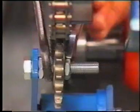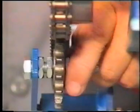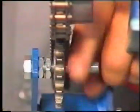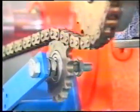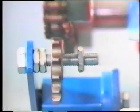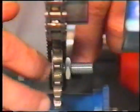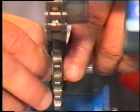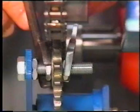On the drive assembly, the recommended procedure is to begin by loosening off both lock units. Next, start the unit and allow it to run, whereby the jockey wheel will automatically find its own centralized position, owing to the action of the chain. Stop the unit. When completely at rest, carefully turn the lock nuts up to the sprocket, then secure evenly so as not to shift the alignment.